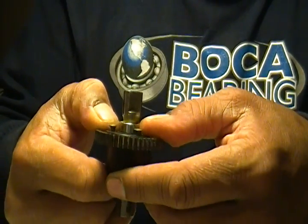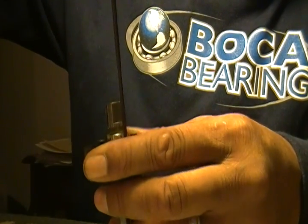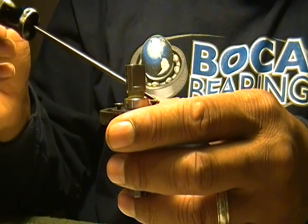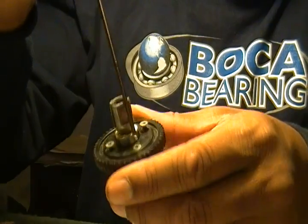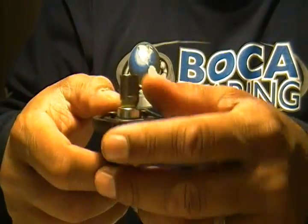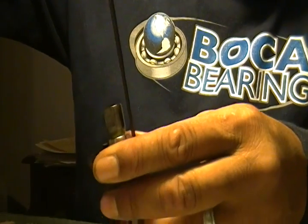Now as you can see, I'm pressing each one in between down. Give it a good press because I want to make sure that it's level. Then I turn that one in some more. Turning my screws in a little bit more. I jump across. Never go this screw, this screw, this screw, this screw, because it's not going to be levelly seated properly. So I'm going from here to this side, from this side to this side, just like you take a wheel off of a rail car. Now I just press those down to flush. I'm going to push them down again just in case it might have popped up. It seems like a lot, but it makes a difference.